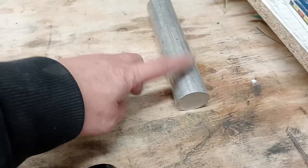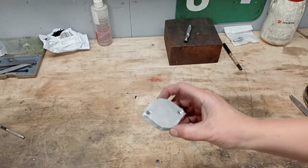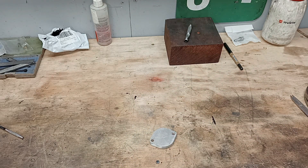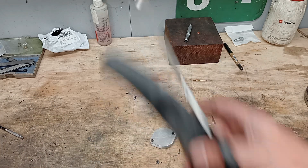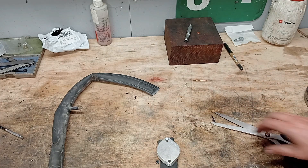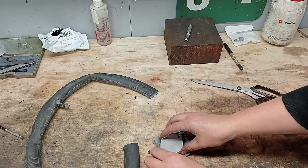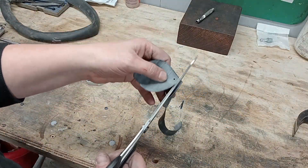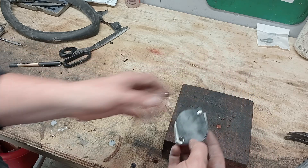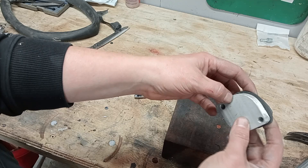Just need to make up the bit for the intake and then figure out a way of blocking the exhaust. I made this bit — it's basically a lump of aluminium fashioned out that fits over the exhaust manifold. It's not going to seal to that, so I need to make a seal. I'll use some rubber — I've got an old inner tube. Just going to roughly measure that out. It'll sit on there and take up any discrepancies. And hopefully that should seal the exhaust up.